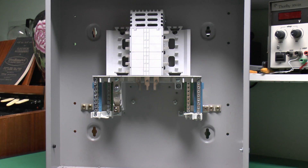In that case, all conductors would be switched. The earth always goes to the single connection over there — that's never switched. This incoming device can actually be an isolator or an RCD. In the case of the RCD, that would be the four-pole — it would have to monitor the current in all three phases and the neutral, and any imbalance would cause it to trip at whatever level it was set to.